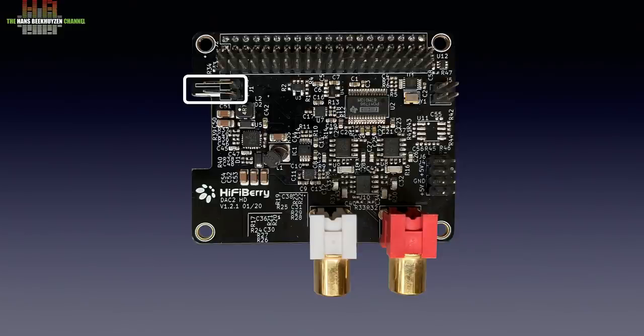That might offer better sound quality. A comprehensive power regulation and filtering section is found here, with in the middle a Texas Instruments DC-DC converter that on the secondary side offers a very stable DC voltage. The DAC chip is the 8-times oversampling Burr-Brown PCM1796, with the clock crystal very nicely placed close by. Three 5532 op-amps convert the balanced output of the DAC chip to a single-ended line level signal.